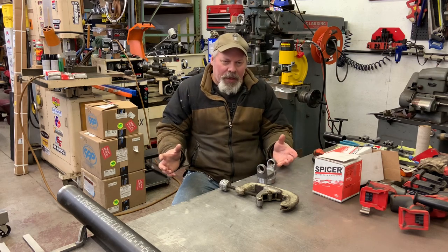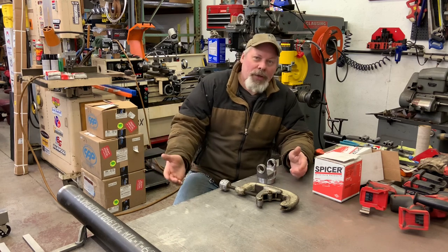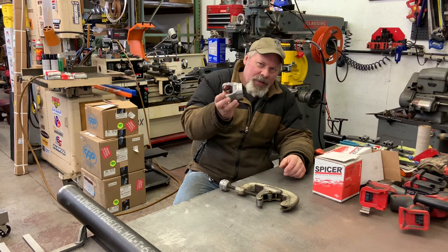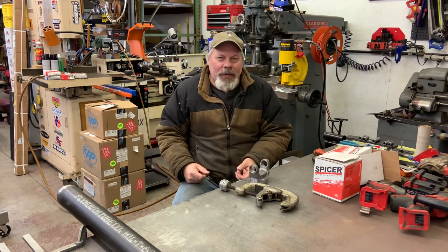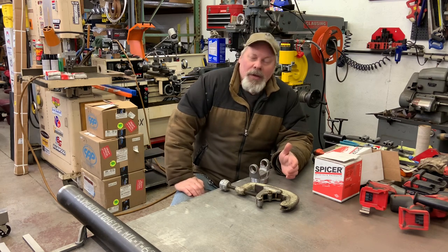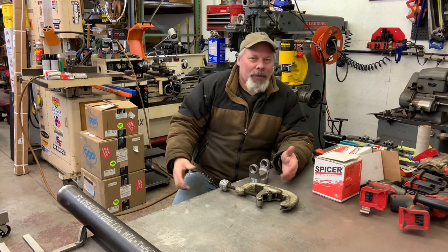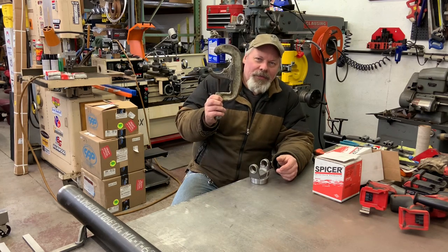My process is to get the tube unpackaged and hope that one end is usable as-is. I'm going to use most of the shaft to build one that's 59 and a half inches long — the tube's only 60 inches, minus two inches for each end. I clean the inside of the tube like a gun barrel — put some cleaner in it and push it through with a pipe or broomstick to get the debris out. I'll stand the drive shaft tube on a rubber mat, drive the one yoke end in first, then carefully measure. I'll use my rigid tubing cutter — the only accurate way to cut a drive shaft.